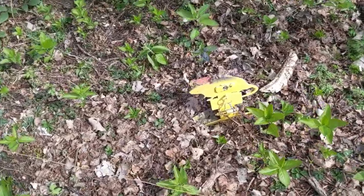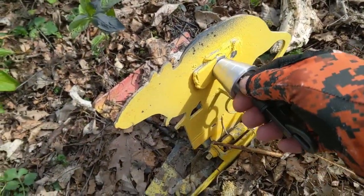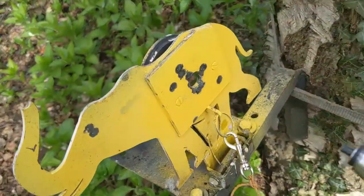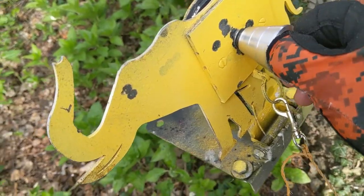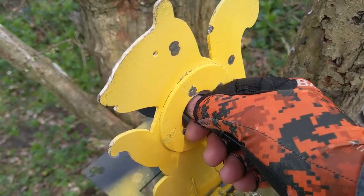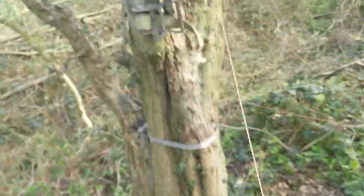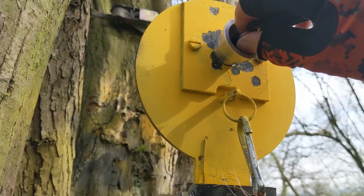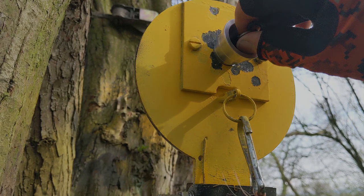Now these targets have holes in them. You have to shoot through the hole. That one is 20mm because that's the diameter of the shoulder of the skirt. That one is 15mm. That's the diameter of the spigot. I've got some graduation markings on the skirt which would tell me the size of other targets. This one is at the longest range we shoot at, that is 35mm. And the last one that was close by, that meets up with the middle graduation line, so that is 25mm. So I no longer have to guess at something that bothers me when I'm trying to practice.